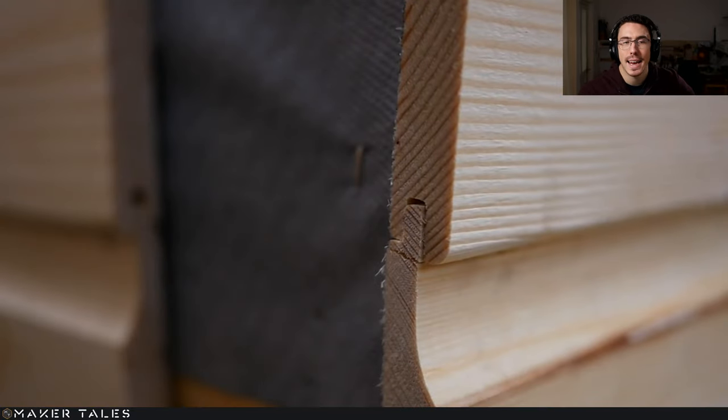It's at this point that I did my biggest mistake. As you can see, I've just gone ahead and placed this right against the breathable membrane, when what I should have done is put a whole bunch of battens across, and then on those battens put the cladding. So I missed one step, and I will at some point, I think, just take all the cladding off, put some battens on, because it's not that big of a deal, really.